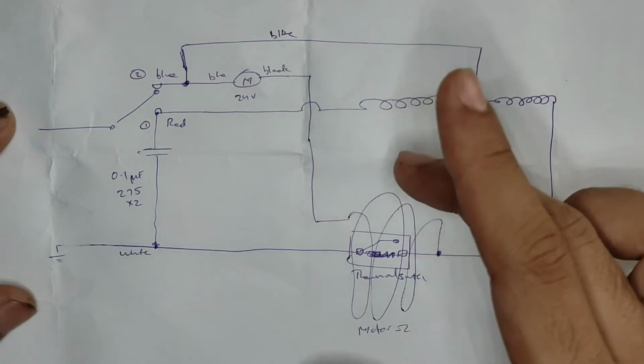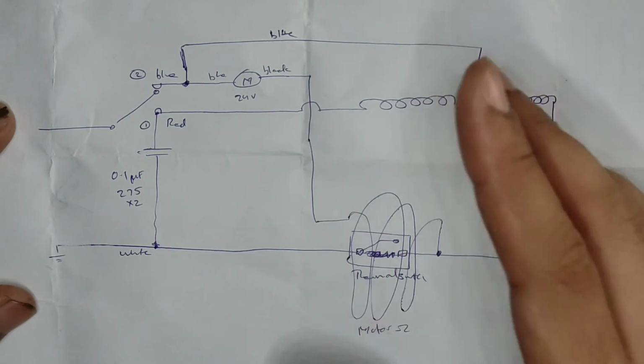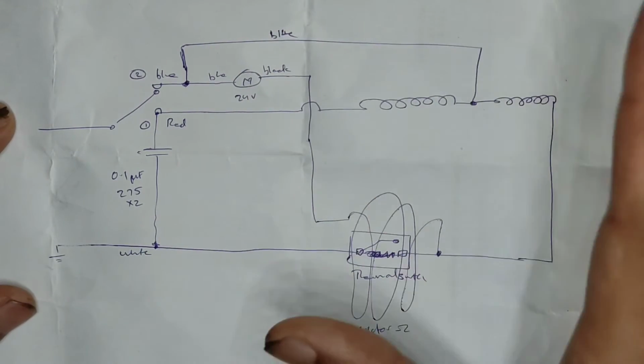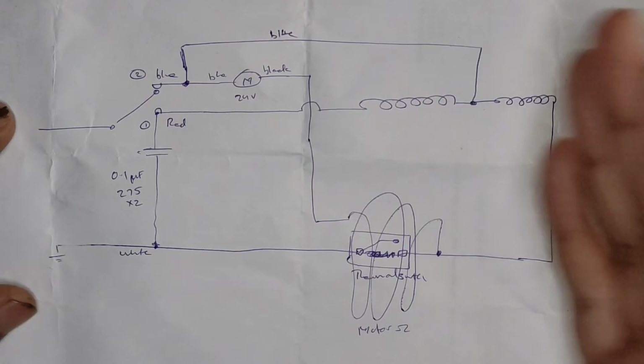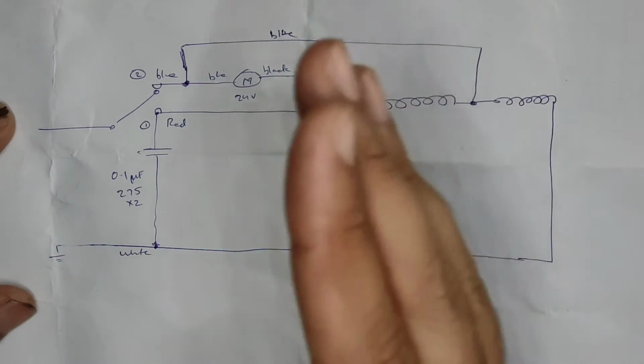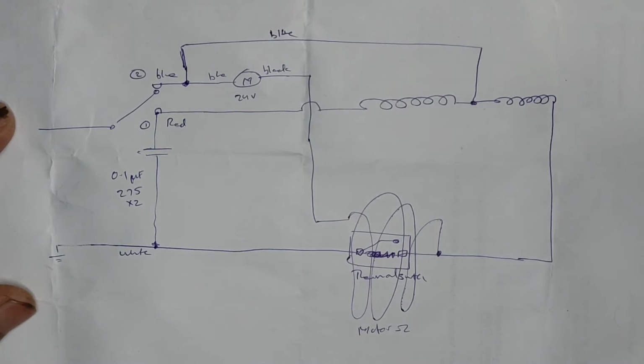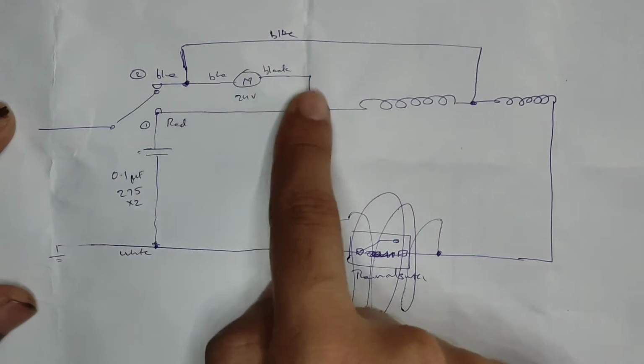So it gets from red hot to orange hot. That means the voltage across this is higher, so the fan speed will increase. So that is the fan side powered. Obviously the airflow will increase from 300 liters to 500 liters per minute. Then comes the interesting part.